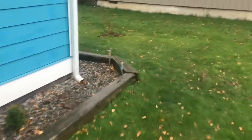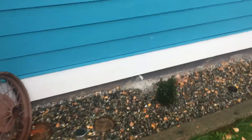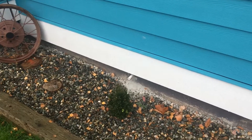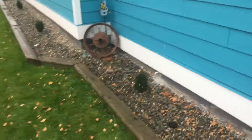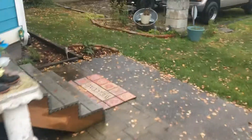Going around the long way, but it is what it is. Another spot we had to core drill through for our condensate line for the dining area floor mount model. There are no lines exposed here — those went straight into the crawl space and then over to the outdoor unit — but we do have this condensate line here.